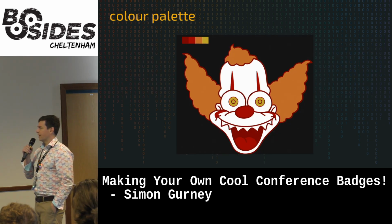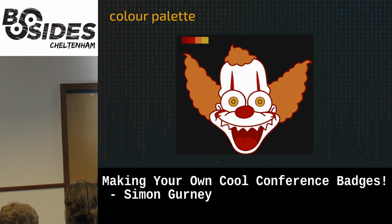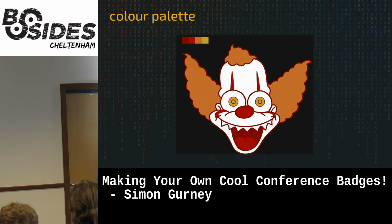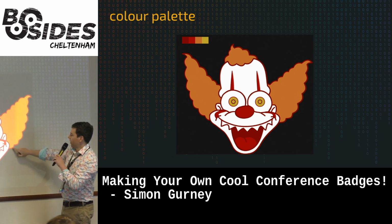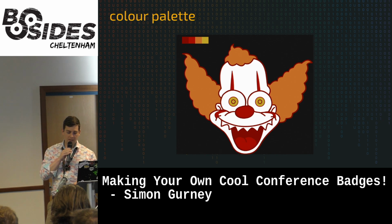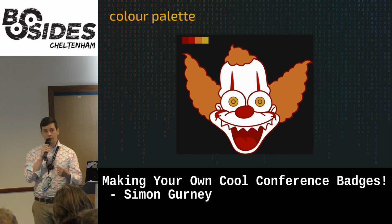So if we go back to Krusty here, you can actually see, this is back of Hackaday, they actually put the colour palette on this picture, which I thought was super useful. So when they went into designing this, they were like, okay, I reckon with the ENIG plating, I can get some gold. This is probably ENIG behind the red solder mask, so I get like an orange. So I've got the copper plate, but then the red over the top. This will be no copper, just red, and we get a different colour red. So they're working out ways that they can produce a picture with a very limited colour palette. So if you've got an idea for a badge, that's where you're going to have to start, is what colours can I produce?